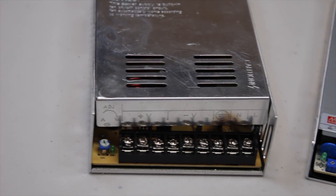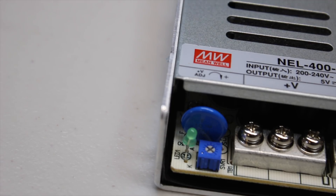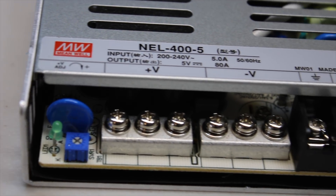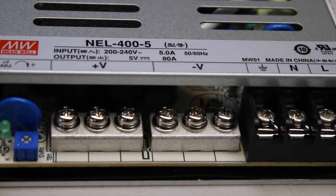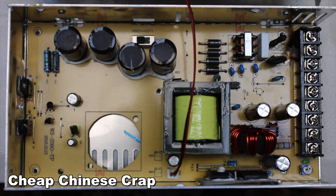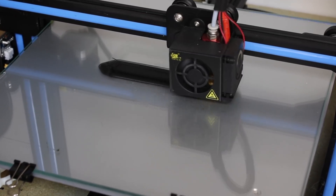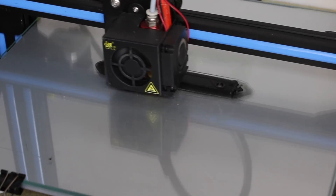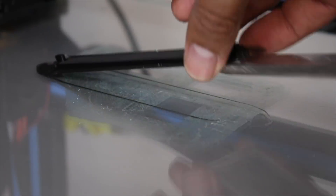My solution was simple: upgrade to a well-specced, well-made and generally reliable power supply unit. I opted for the Meanwell NEL 405, which is a 400 watt, 5 volt, 80 amp power supply unit. It feels solid and well assembled with higher grade components and all-metal output connectors. Everything inside seems to be beefier, bulkier, and just the business. It's double the price of the cheaper one but still half the price for peace of mind. The only negative is it does not have a wire guard at the top for safety, but nothing that a 3D printer can't fix.